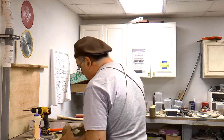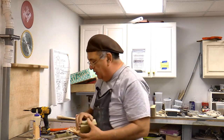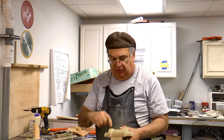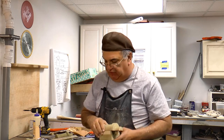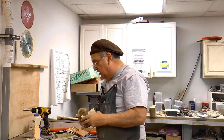Let me just give you an idea how it's going to look. This is going to go like this — it's a big jigsaw puzzle, right? A Rubik's cube. The part I just made is going to extend into there and out to there, and there's your cylinders. That's how it's done. That goes in there — we're going to glue that in there up to the right length, and then that becomes the pattern. Once I get it all glued together, I'm going to put some more paper on this, line it up real good, put these two together with paper, glue it, finish it. Then once I get it glued, I'm going to decide where to put the pins to line it up on both sides of the match plate and drill it while it's all lined up correctly. If you try to drill it separately it could move off — if it's slightly off-center, then the parts shift.